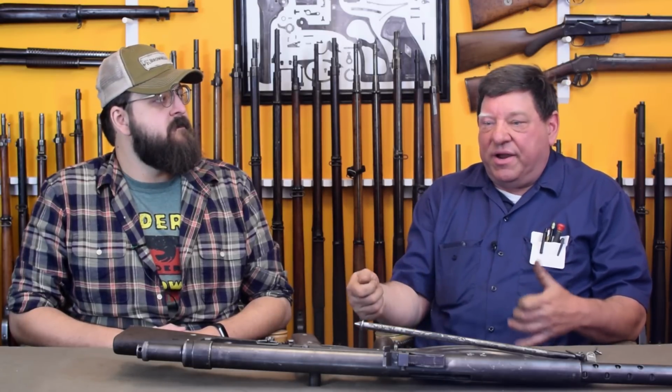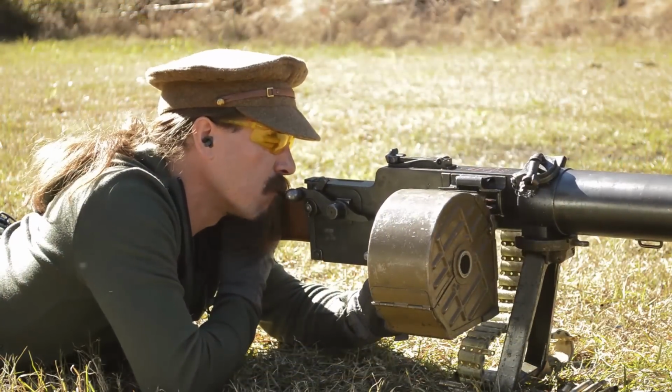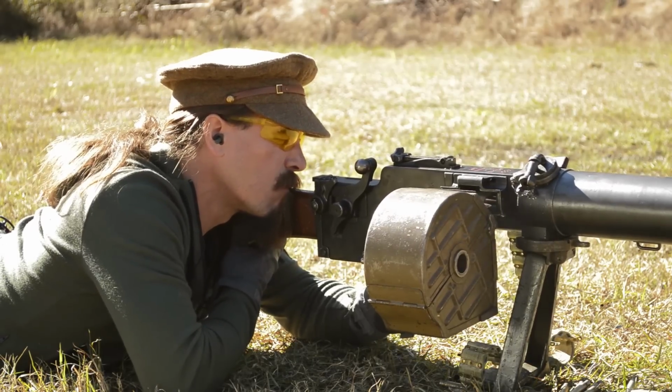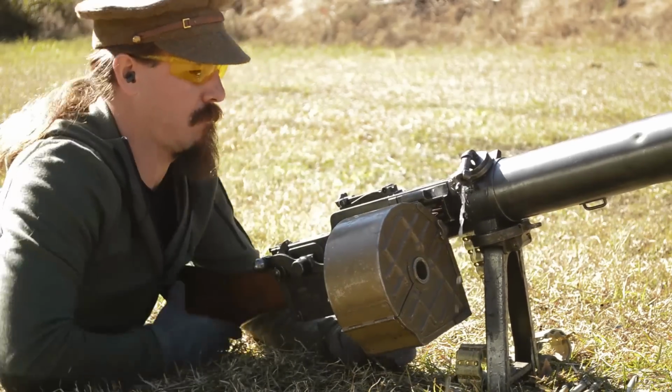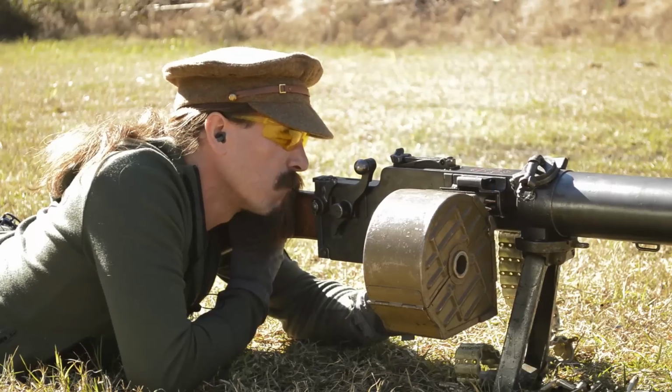So there is a sweet spot in there that you can find, where I don't think the gun's physically capable of running much faster than you were running it. Harder was the wrong word. We dialed up the spring tension and it started running much better for the B-roll. Right at the end, it started getting sluggish. We were starting to get some fouling because the gun's a little looser, so it's letting fouling drool through the rear seal.